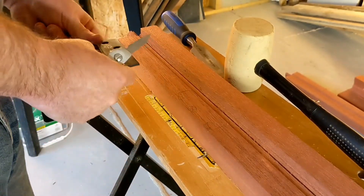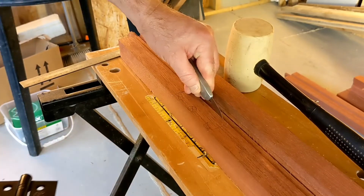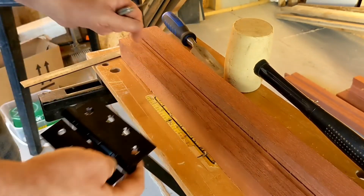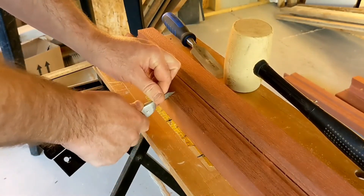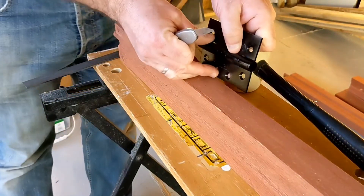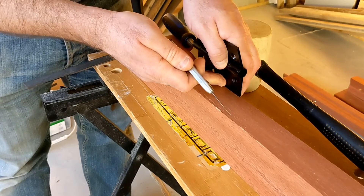Make sure it's in the right place. Now this hinge — I'm pretty sure I'm going to lose this back part; this is rebated in here for a weather seal and that hinge depth is about three mil off here. I'm fairly sure as I start chiseling this out that piece is going to break, but that's fine. On your edges, just make sure you can see the edge transferred down there. I also hold the hinge up on its side, hold it level at the front, and try to transfer the depth of the hinge — this will just make it easier when doing the chiseling out.